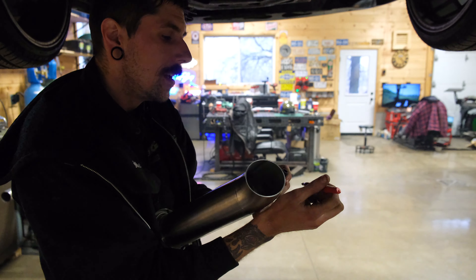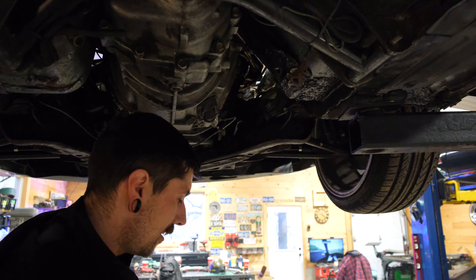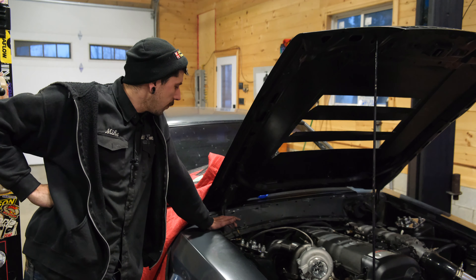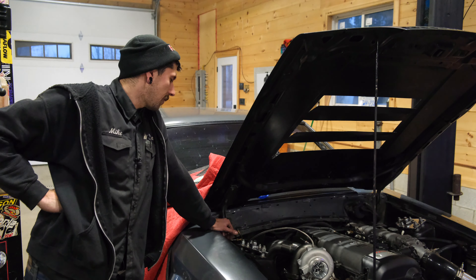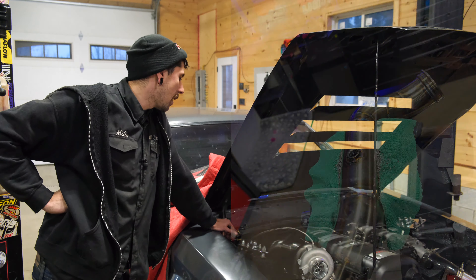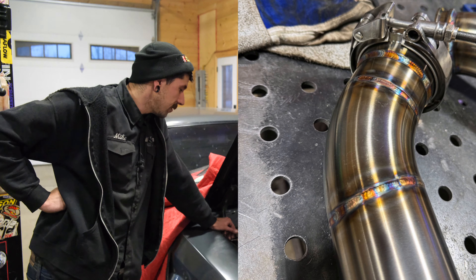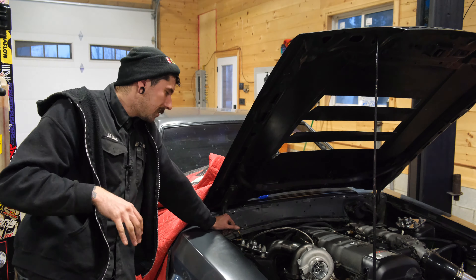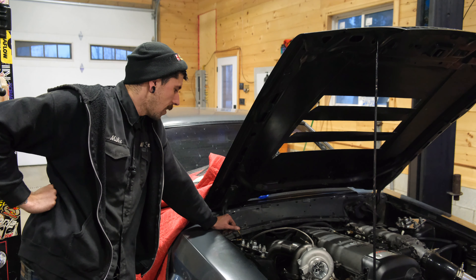Cool — so I got three squiggly little marks in there, we're gonna bring her down, tack that, and we pretty much have a completed mocked up downpipe. And then once that downpipe's in there and we make a section out, we know our clearances for the wastegate dump tube. All right guys, so that fits perfect — happy with that. Now is the cleaning it all, welding it all, probably gonna make the dump tube, film some stuff of that. It's not the most interesting stuff — we'll put some music over it — just welding tubes. It takes a little bit of time, but this is the most gratifying part: click, click, click, click — pieces come together pretty quick and your point A to point B — happy camper. Now it's making it all look good, which is half the battle.